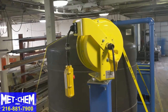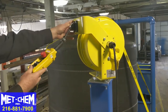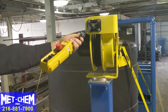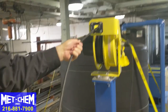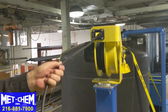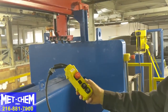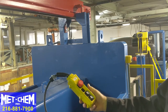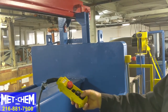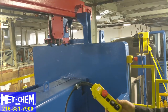Now it's time to use the plate shifter. The control pendant is on this retractable swivel base. I pull the cord out to where I'm going to be working — you can hear it ratcheting three clicks. When it hits those three clicks, you can stop and it'll hold its own place. Using the close button moves the carriage to the tail of the trailer; using the open button moves the carriage to the cab of the truck.